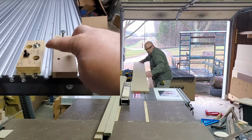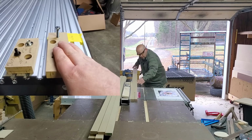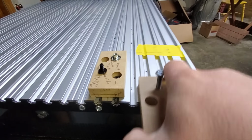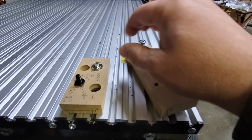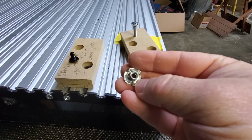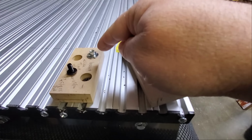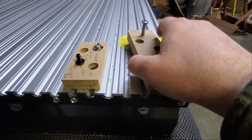So what I did was I created a spacing between each one, and on each spoil board strip I'm going to have a T-nut embedded on the bottom and recessed like this. So that's going to allow me to have functionality here. The nice thing about that is it has a really wide shoulder, so I get plenty of support on the bottom side as things are pulling up. And unlike a threaded insert, it's not going to pull through. So that's going to be much stronger than the threaded insert and much more stable to the part.